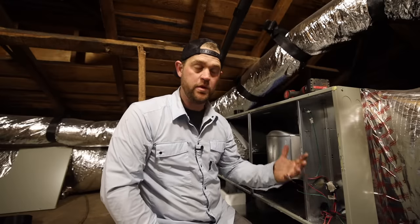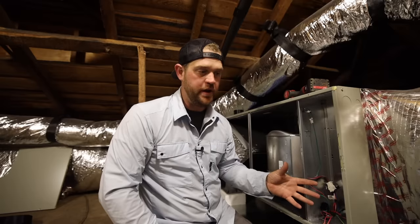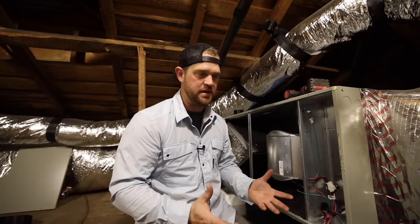I've got the line set complete up here. I'm not going to put the dryer up here — I want to put it outside. I'm a fan of putting them outside because that's where you're going to be typically when you're working on the refrigeration side, so you can swap out the dryer when you're out there. I'm not in a salty coastal climate, so it's never a problem. A lot of manufacturers put their dryers in the condensers from the factory anyway, so it's not really a big deal.